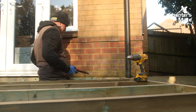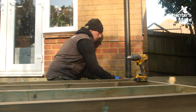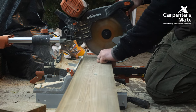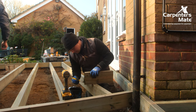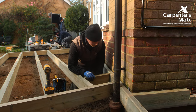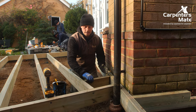The easiest way to handle the joists coming in at such a steep angle is to take the mitre you got earlier, transfer it here, which gives you a square noggin to work from. We're using black jack on this one to waterproof our cuts — the timber is treated right through but it just gives a bit more protection. We put this noggin in tight and then run our new joist square to it, avoiding a really long angled cut.